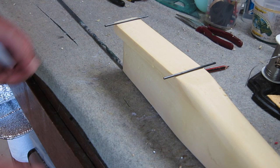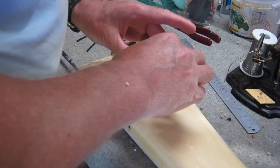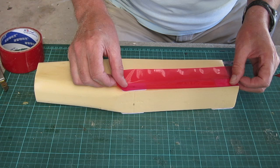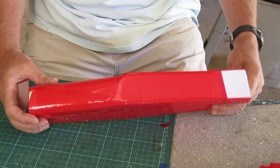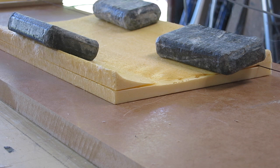Now I'm placing the tie-down bars. I've left the top part of the fuselage full width so that the wing has something to sit flat on. Reinforcing cards for the tie-down bars are hot glued into place and drilled out so the bars pass all the way through. I cover the whole fuselage with colored packing tape as usual, which adds a lot of strength. This is the reinforcing patch for the motor mount, then finishing up the tape covering for the fuselage.